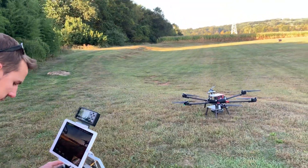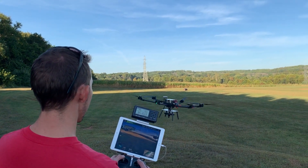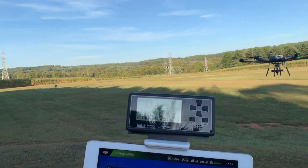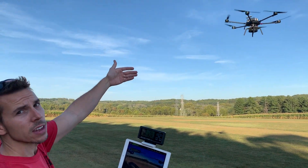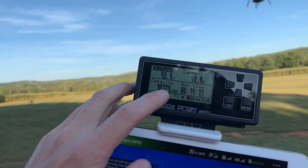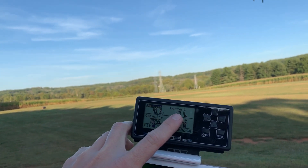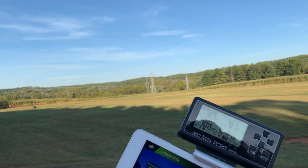Let me take it off quickly so you can see how this works — it's really quite simple. These are 16,000 packs, so I'll do 12,600–12,800 milliamps, no more. In flight you can see our voltage, capacity going real time from zero, and current measuring about 40–45 amps at the moment. The whole system is drawing 80 to 90 amps. And here's our runtime. That's really about it.